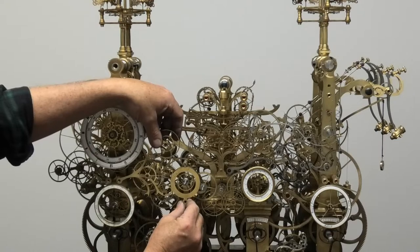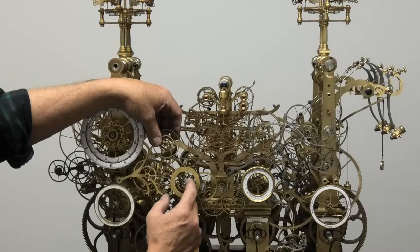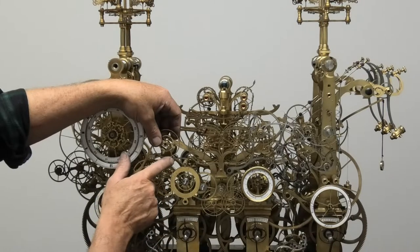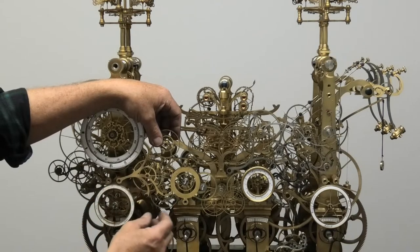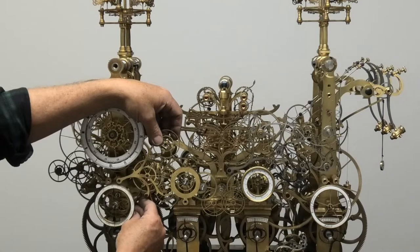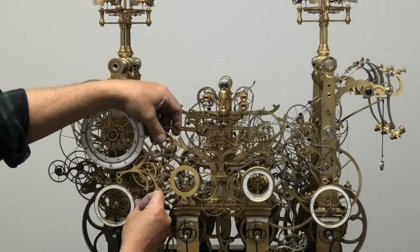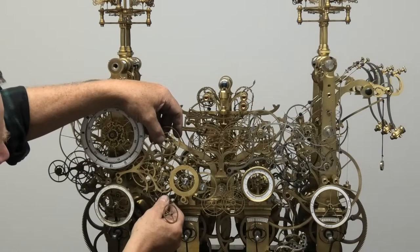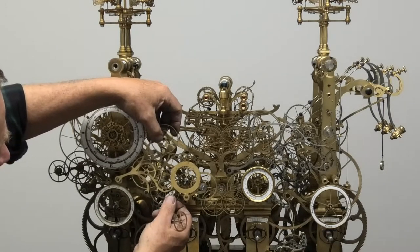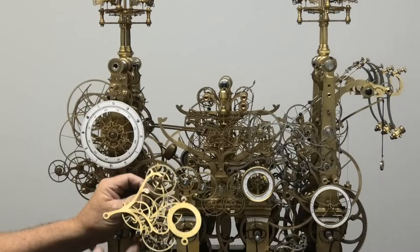It is just brought forward slightly to release it at the time dial pivot. The demonstration drive gear is in front of this idler gear, so it has to be removed vertically. So once we've released it at both points, the front and back, it's gently lifted upwards until the worm drive pivot is clear, and then it is loose. So there we have the complete transfer gearbox.